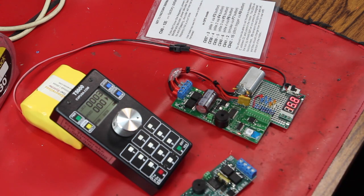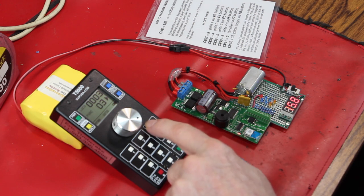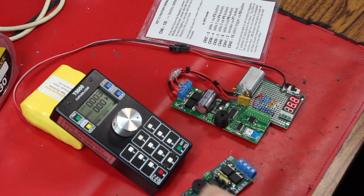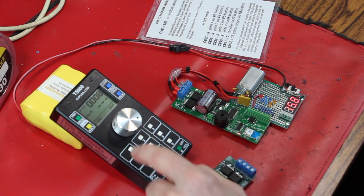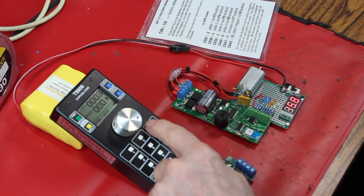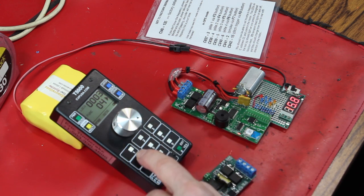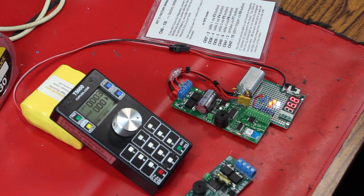So now, before I hand this back to its owner saying, hey, I can't find anything wrong with this, or I fixed it, we'll use those words interchangeably, we're going to again set it back to the factory defaults. We're going to undo the programming in which I've set these Elite side LEDs to operate on. So once again, we go back to ops mode and CV8, enter, and 1, 3, 5. It's going to beep at us. Beep! We escape out of all of this, and F3 doesn't do anything. F4 doesn't do anything. Headlights still work, that's the default. Can't do the trigger. So all that programming is gone and flushed out. Again, the board is set up, ready to be installed in the locomotive and programmed by the owner.